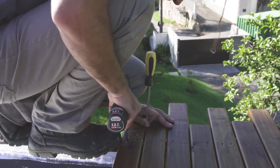So the way we do it is we screw one side and then we keep pushing and pulling to place and screwing, pushing and pulling to place. What helps a lot is a screwdriver, the yellow one I'm using now in the footage. When you have no gap, you put it in between and push to place. And we have a regular distance in between pieces of decking. That's our measurement, the screwdriver we put in the middle, so we know the distance, and we keep doing that.